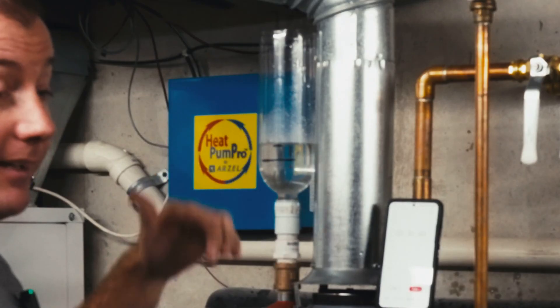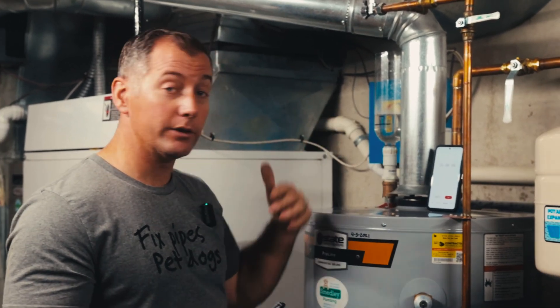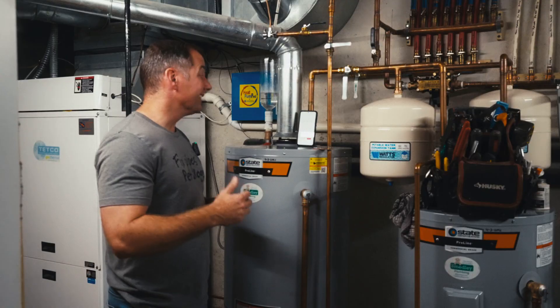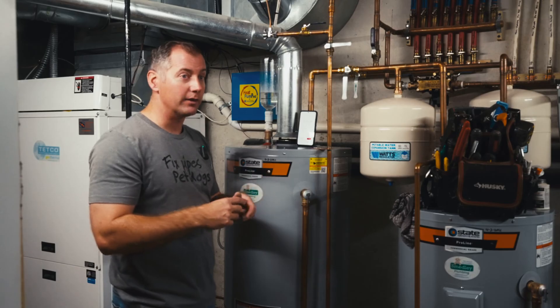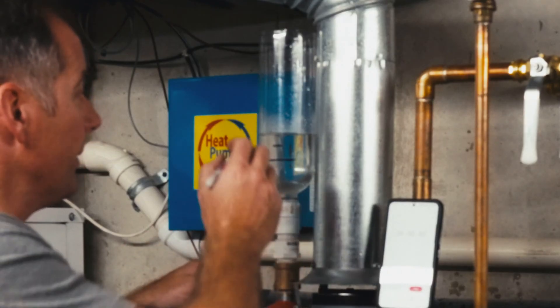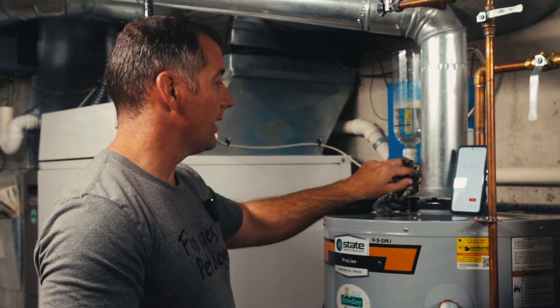The water is still expanding. In a closed system, the thing to keep in mind is: where does all of this extra volume of water go? It gets distributed evenly throughout the system, but in the form of pressure, because it can't go anywhere — unless you have dripping or leaky faucets where water escapes. At this rate, there aren't many other places for it to go, so it just builds enormous water pressure.